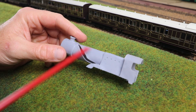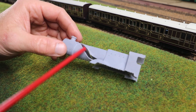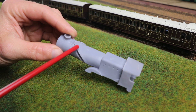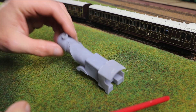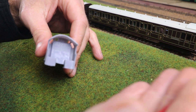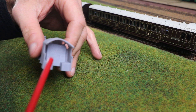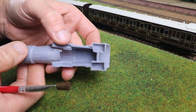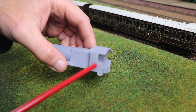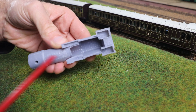I took this print in to show some of the pupils at the school where I teach, and this has been passed through a few hands — I'm quite certain it wasn't as destroyed as this when I gave it to them. But it's interesting; it shows the extent of the forces that are built up in this thing as it cures. Additionally, there are a couple of other defects: this cab side has bowed outwards slightly. I think that's differential curing from the UV light on one side versus the other. I go to great lengths to cure this very slowly, rotating it all the time, doing my best to get the light in and cure it evenly, but it's very difficult on a complicated shape like this. So it's got me thinking — are there modifications that could be made to try and minimise some of these effects?